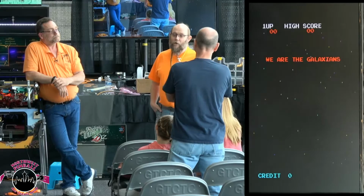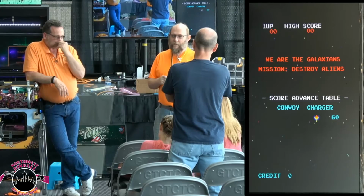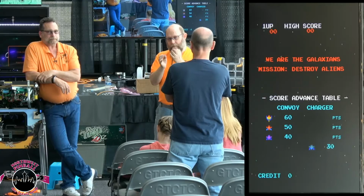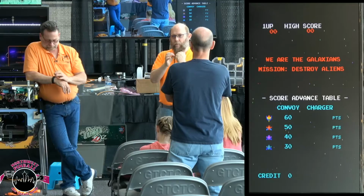It can work. The trick with any of those suction ones that I discovered is I take a pair of snippers and I cut a little V in the end so that I can get it down over the soldering iron without having to do this switch thing. And then the problem with that is every time you fire that, you're going to bounce a little bit. And that's going to push the tip of the soldering iron into the board.